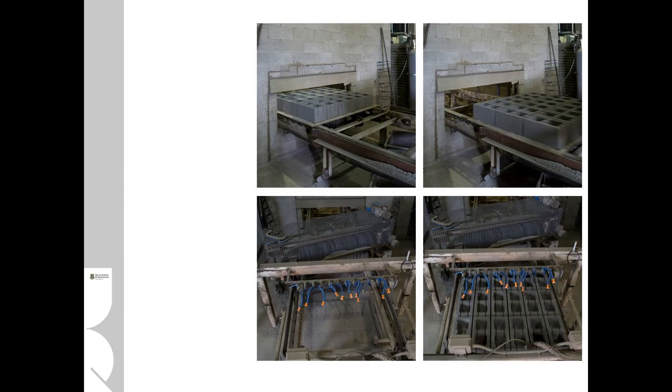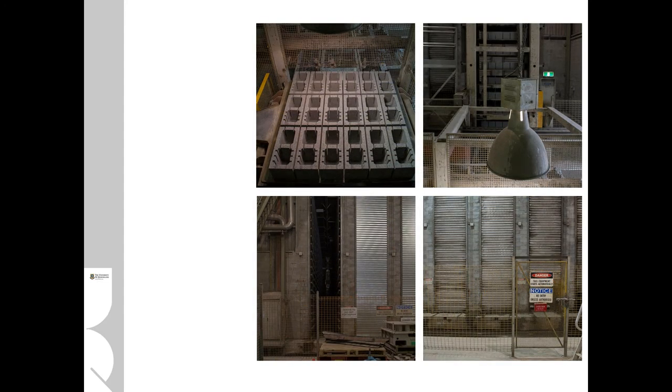It is really a simple process. There's a large machine that just pumps rack after rack of concrete blocks. Each process takes literally seconds, uses a lot of pressure and heavy vibration, and pushes the very dry — almost 10% moisture — mixture into the block, releases it immediately from the mould and pushes it down the line. We can see the trays of concrete blocks going further down the line and then into quite tall steam chambers where they will be placed to cure for a considerable period of time.